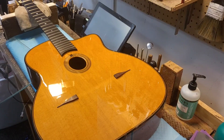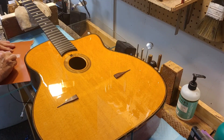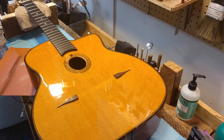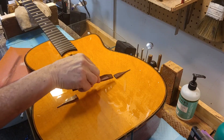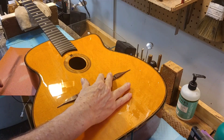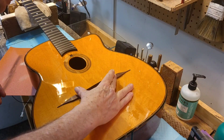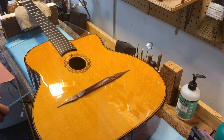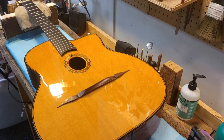We'll take a piece of glass and some 180-grit sandpaper — it'll cut pretty quick. I don't want to go crazy with it, but I do want to make it flat. Now let's set it in place and see what it looks like. We definitely lost about two millimeters from there — you can see the wings are somewhat higher now. We brought it down our two millimeters, which is all we really wanted to do just to compensate for that little extra high string height.